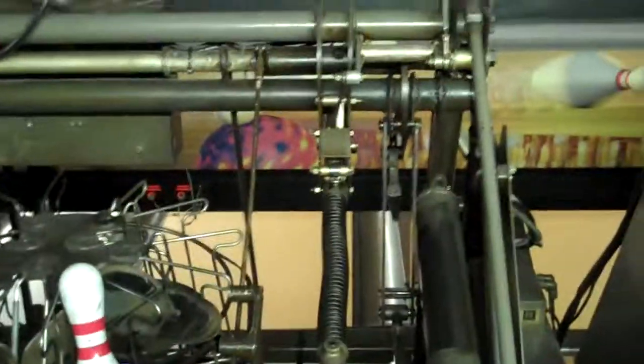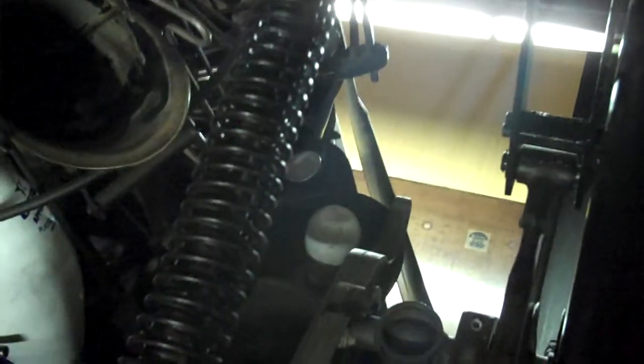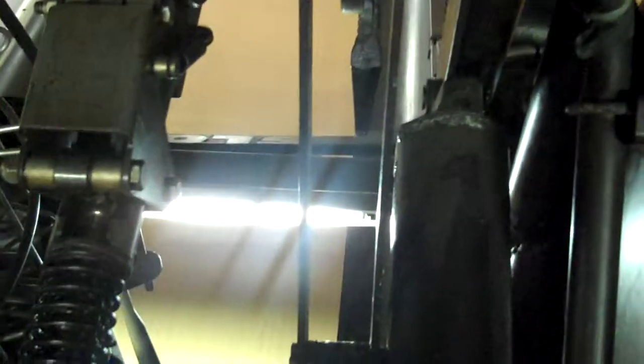Aside from all the other components, that's the basic gist of it. I'll turn this on and get a couple of cycles for you guys. When it turns on, the hook will raise once it starts cycling. I'll get in a little closer. There's the hook right there — you'll see it raise up out of the way and then drop back down. You'll hear a click when it engages — that's 135 degrees. And when it releases, that's 225 degrees. You'll see the hook raise up so the block misses it, then drop — that's 135 degrees — and then 225 right there.